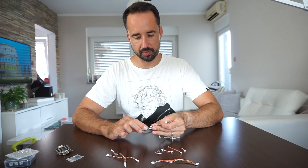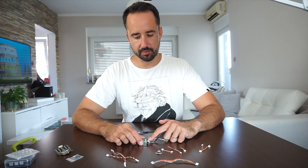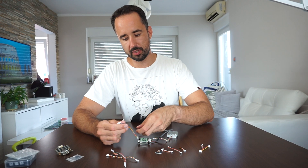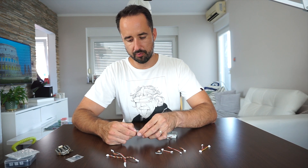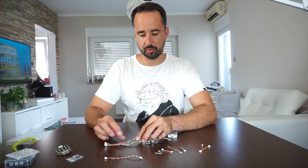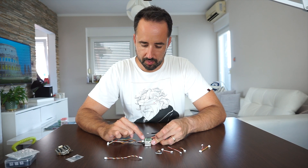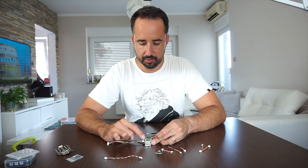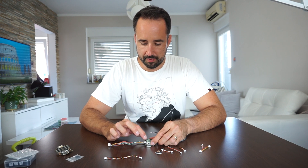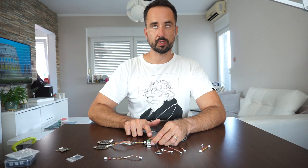Starting over: we have ground, 5V, RX, and TX on this connector. This is likely for your receiver — you can use Crossfire, ImmersionRC Ghost, or whatever you prefer. This other one is for the ESC, and there are also two pads here: ground, VBat, motors one through four, current, and RX.